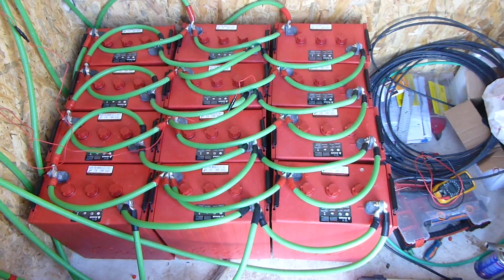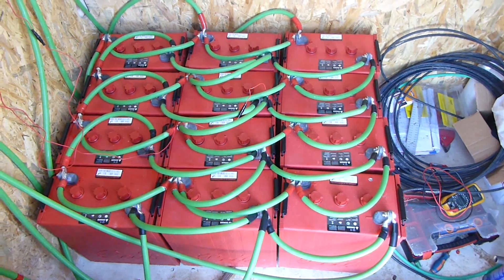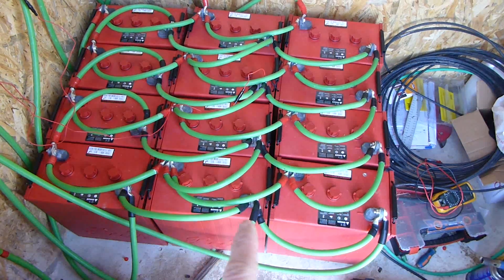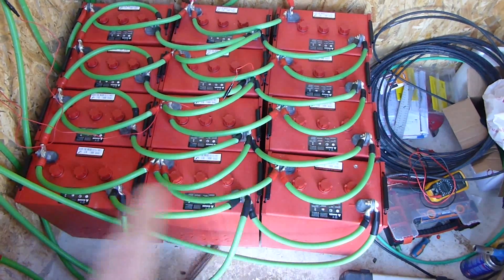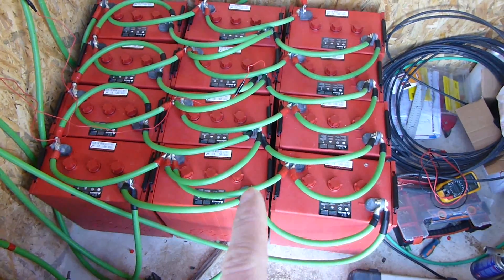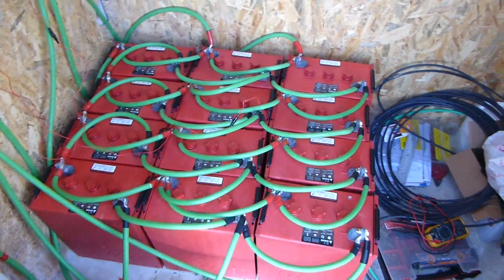I was looking it up, and the solution that I found was running this configuration. The people at Tesla Chargers call this something like hardwired equalization. So what I have done is I have linked all of the parallel connections. You see two negatives here, two positives here — so all of the negatives and positives, all of the parallel connections are joined. And at the beginning of each string, I have an individual cable going up to my bus bar. So the individual negatives are going to the negative bus bar, and the individual positives are going to the positive bus bar. What this does is it allows a much more even charge of the batteries.